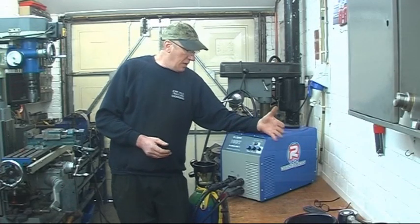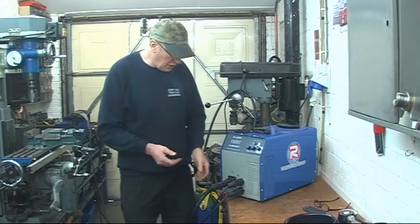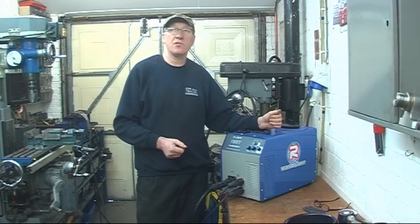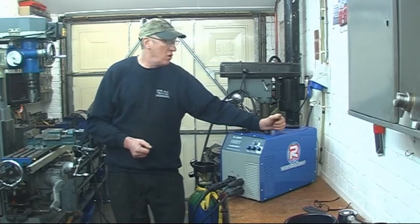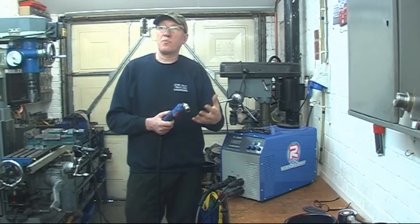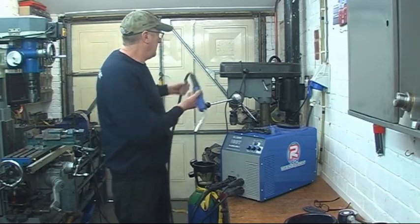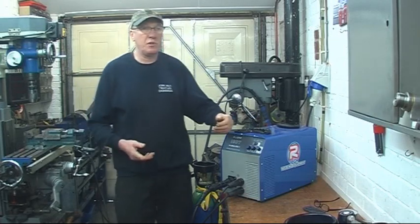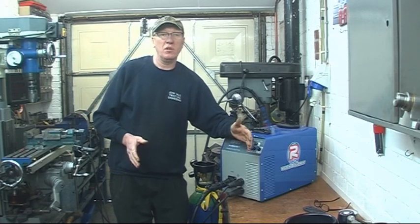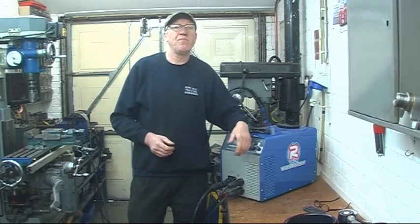I'm not quite finished playing with the welder yet - I've got some aluminium wire coming, an aluminium roller, and a different sleeve for the gun, so I'm going to try some aluminium welding with it. I've got the pure argon gas. I've done aluminium welding with MIG before but used a spool gun - so it'll be interesting to try it with the actual torch on aluminium and see what sort of results we'll get. The aluminium welding I did was with a transformer type welder, so having an inverter welder should theoretically produce a better weld. Anyway, that'll be for the next video. Thanks for watching and thanks for subscribing.